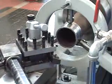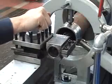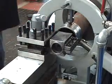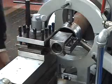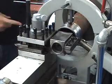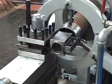Good — about a sixteenth of an inch. Now that sets me up for boring. I'll rotate the tool post into position and lock the tool bar. I'm going to run it through to the very end to make sure I've got enough clearance. I can see interference with my tool post so I'll pull out the tool bit — always got to make sure there's no interference as the feed runs. I'll grab a felt pen and put a little mark there so I can determine my stop point by sight and sound.